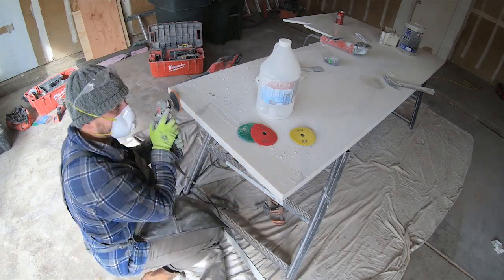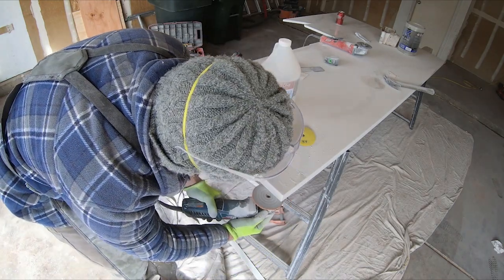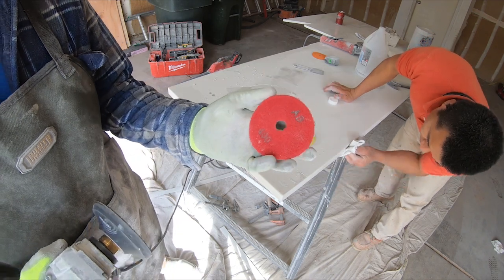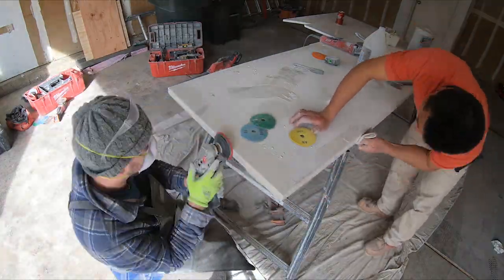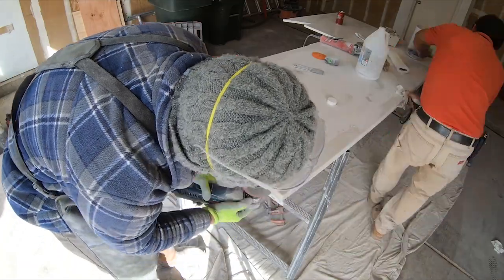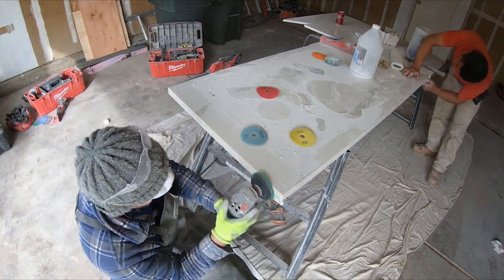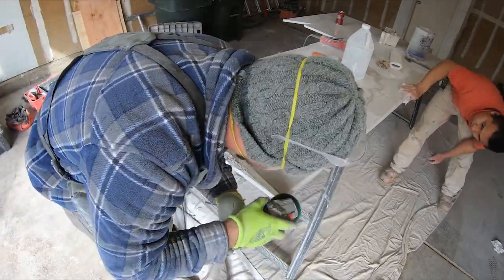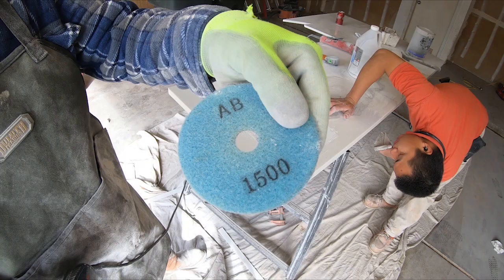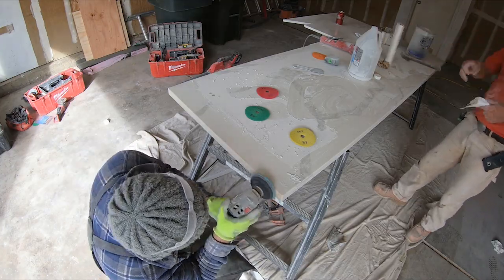Now I'm doing a 200 grit. All of these pads I purchased at a local store — they're about $23 each. There are cheaper pads that other stores sell, but they are just not as great. They'll be like $5 a pad but they're really plasticky and leave a lot of residue. You can try them out, but you get what you pay for. This is a 400, then 800. After 800, this is quartz — this is called Calcutta quartz — I go as high as 1500. I don't go any higher than that because it just doesn't do anything.